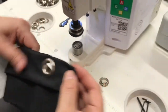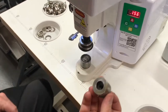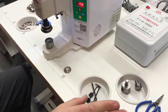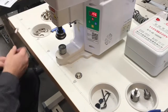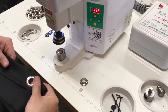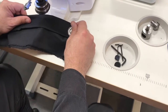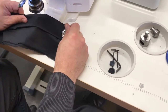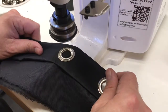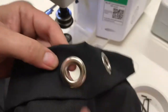This is the back and this is the front with no holes in it. The customer also wanted a hole cutter, so we have one for that too, and I'll show you how to put that on. One more time — four layers, grommet on top, washer on the bottom. Put the fabric, vinyl, or leather down. I'll do it slowly so you see how the swing works. Even if your hand is in the way, this will just take your hand out of the way and press. This is your result — back and front.